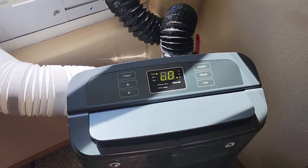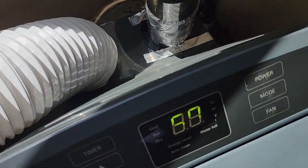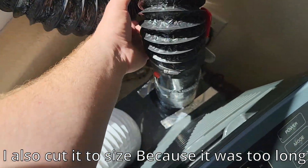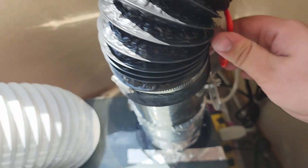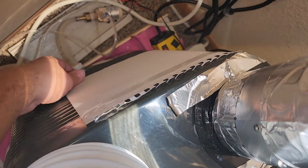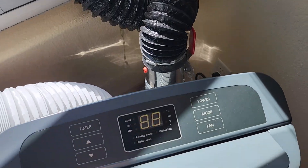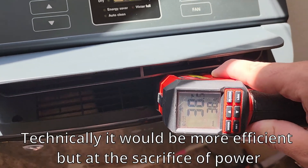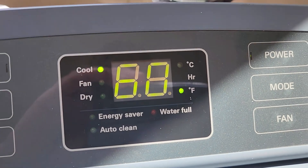I've got it running right now. The 6-inch hose output is nice and cool, but if you feel underneath it's really warm — so it's definitely working. Over here is our little air return. I know it's a little loopy — I'm going to have to twist it so it straightens out. This hose is super springy. Right now the air valve is completely open. The 4-inch is actually working pretty good — a lot of air is coming through. I put a piece of paper on top so now I'm using roughly an 80/20 to 80/30 mixture. I don't want to use 100% outside air because sometimes it gets really hot outside, but the air coming out of the unit is really cold, so it's still working like it should.